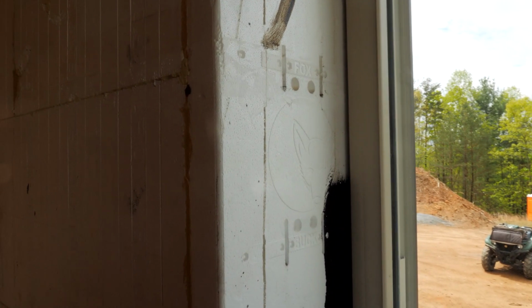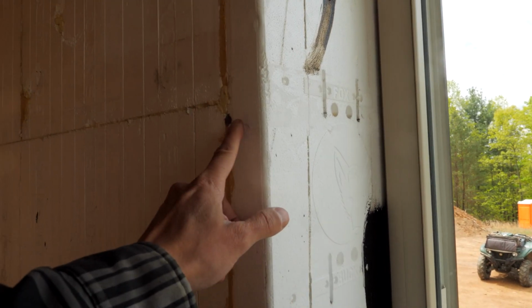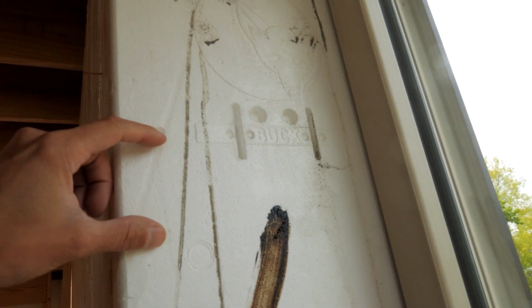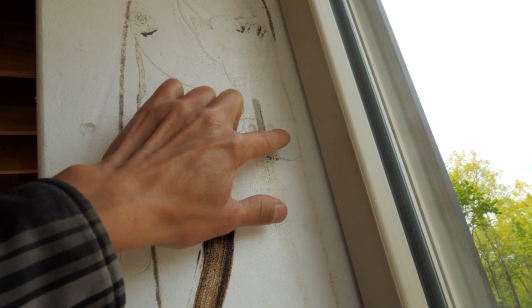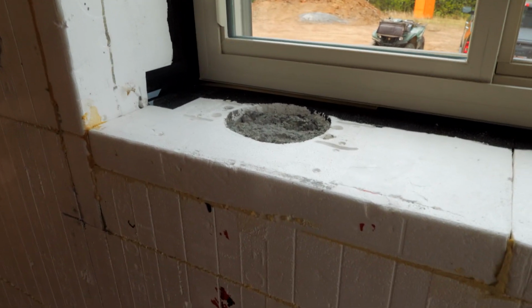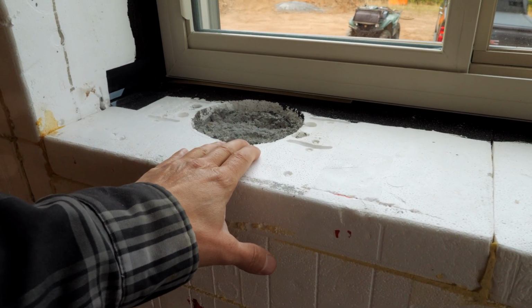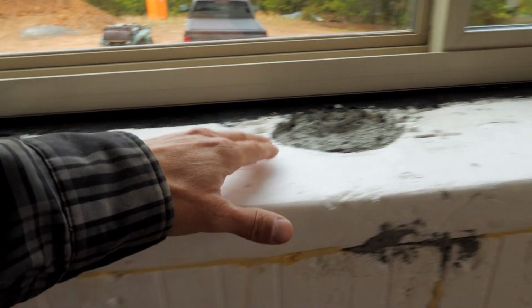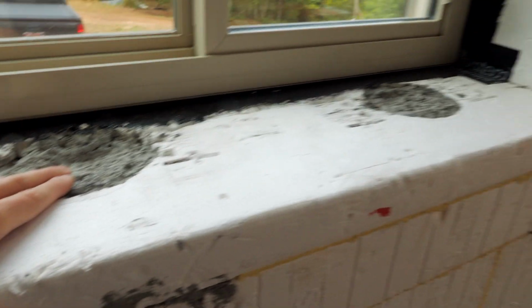It has a continuous plastic stud inside here and everywhere that it has this writing. So there's a stud in there. So you could fasten doors to the inside, windows to the outside. And then when you lay it, you cut holes so you can get your concrete up to it and consolidate it. You put the vibrator in here, bring the concrete up to here.